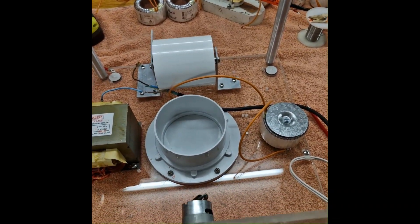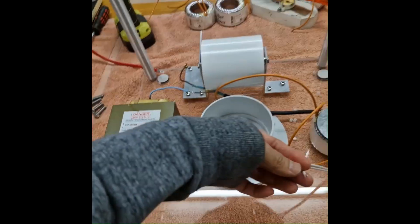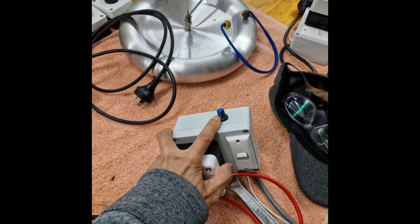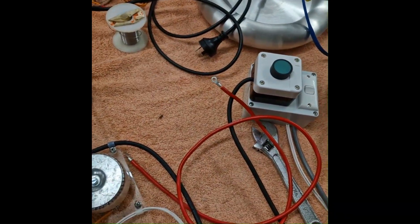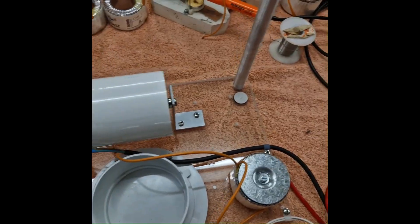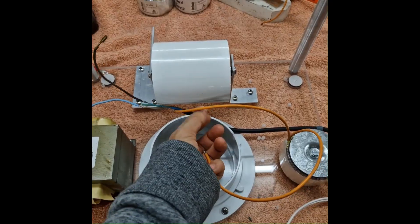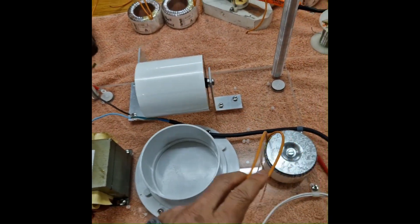Now it's just a case of wiring up and wiring it to the primary coil and fitting the secondary coil. We've got the rotary spark gap motor power wire that runs to the control box. In the control box is a motor speed controller adjusted by this. The rest of it is power that will run the microwave transformer. The power from the control box via these switches will switch on the power. One line will go directly to the primary of the microwave transformer, and one line will go to the current limiting inductor, and then the other side of the current limiting inductor will go back to the primary coil of the microwave transformer.